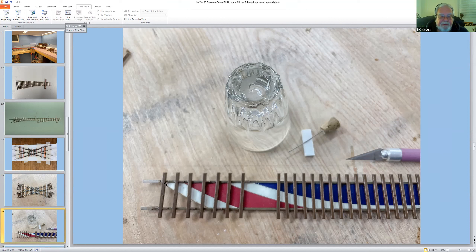I super-glued one tie making sure it was absolutely square, then used a little spacer — about 0.125 by 0.25 — put a drop of super glue, slide a tie in place, move the spacer, and just keep pulling it down the rail. The super glue holds pretty well but you will get ties to break loose, especially if you mess with it — but a few skewed ties here and there just gives it a more realistic effect.